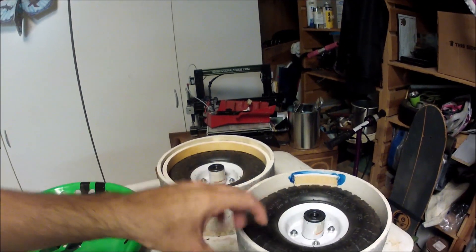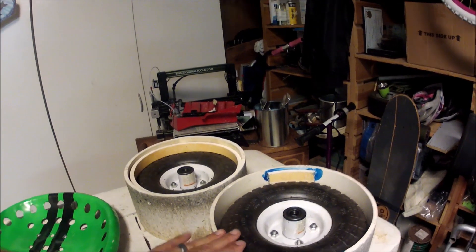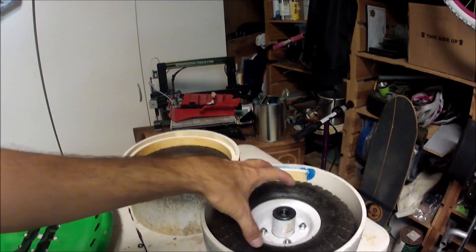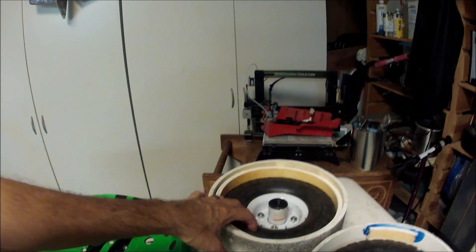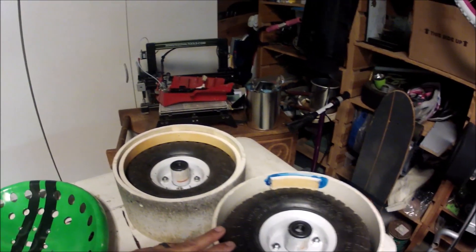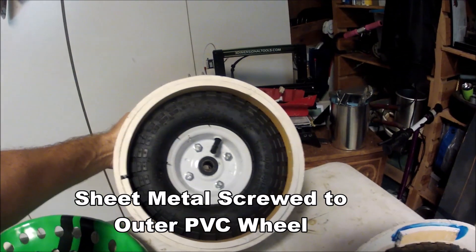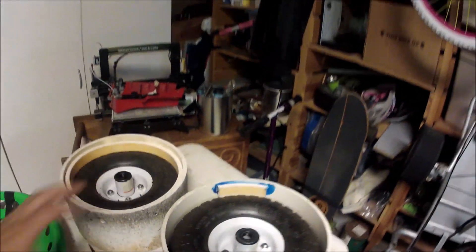So you've got the upgraded bearing and the wheel. Essentially what happens is we use a large diameter PVC pipe — somewhere around 10 inches. You insert the tire deflated and then when you get it centered up you inflate the tire and it captures it. It's a little like the drum sander on your Dremel — the more you crank it the more the rubber expands and grips onto it. The only problem with these Harbor Freight tires was that even with them expanded they still weren't gripping a hundred percent. So I experimented with putting another ring of PVC on the inside and that has worked out fantastic. I have not had any PVC slicks slide off since I did that — really good mod.